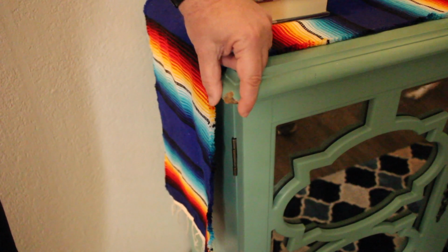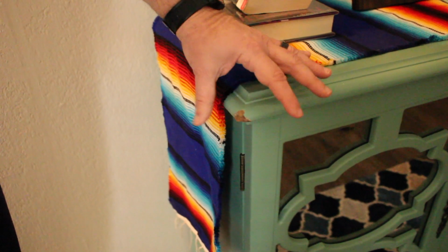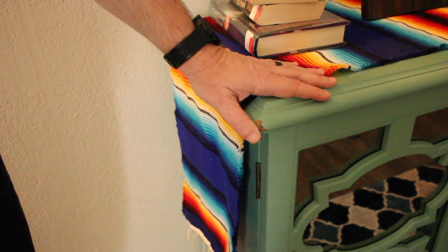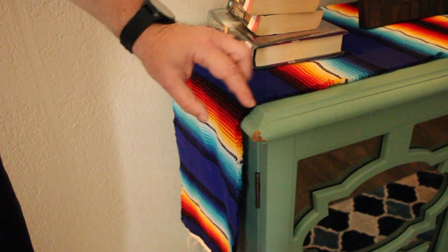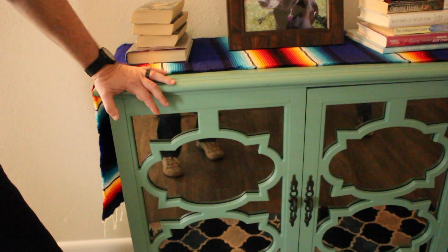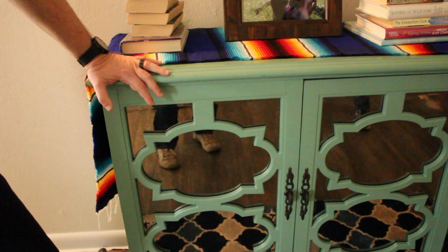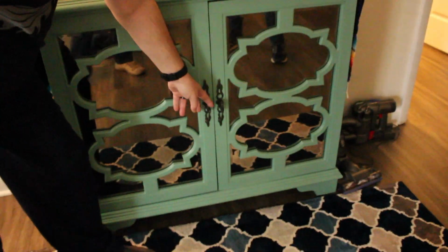Yeah. Or if you don't want wood filler, because this is very, very tight, it doesn't have damage, you can actually use wood glue and let it dry. That will smoothen it. Does that make sense? Okay. So something like that should not scare you away. That is an easy fix. Now, please don't do really silly things and paint this in a color that destroys it. We've seen that in people. I mean, again, it's your furniture. You do whatever you want with it, but this has a nice classic look. Very nice hardware, which we like.